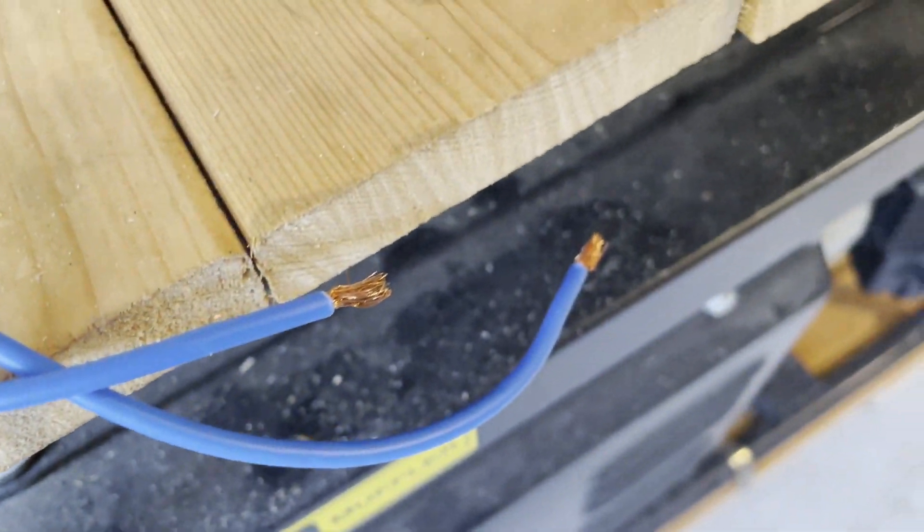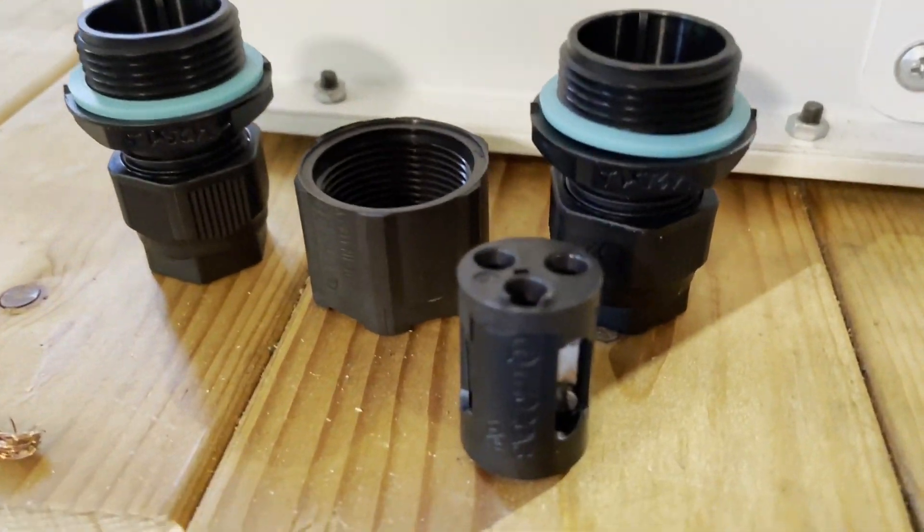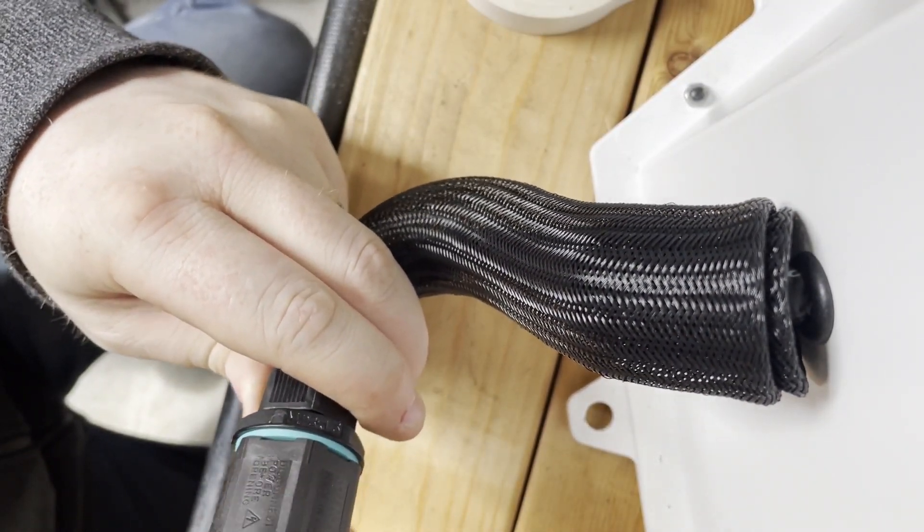The other concern I had was how I was actually going to connect the wind turbine itself. The wind turbine comes with three output cables and they're just cut at a random length. So I purchased an IP68 inline cable connector, three pole, to take the three phase cable down to where it's going to connect up to the charge controller. That cable connector is just a barrel — it's water resistant, watertight, waterproof hopefully, dust resistant, dust proof. So in theory nothing should get into that once we've securely connected it up, and that should keep all the weather out and away from the connections, stop them from oxidizing or going bad. It also provides an easy way to connect and disconnect the turbine should we need to take it down for maintenance or any reason like that.